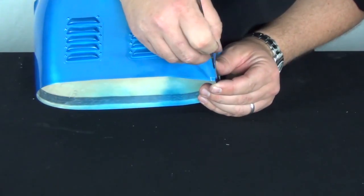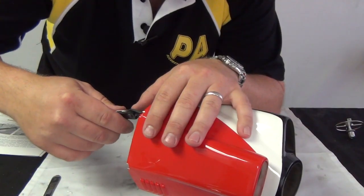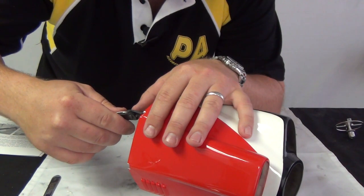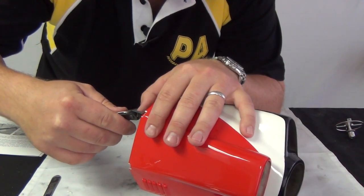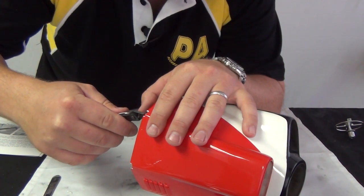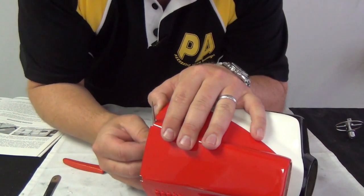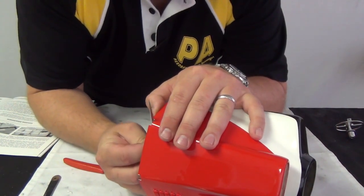Then remove it and either continue cutting through with a blade, or better yet, cut along the edges of them with a sharp pair of cutters. Deeply scoring the surface will prevent the paint from popping as you make these end cuts with the pliers. I then nibble away at the area and clean it all up with a needle file. No other trimming of your cowling will be necessary.